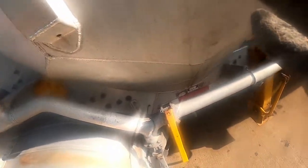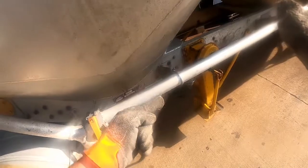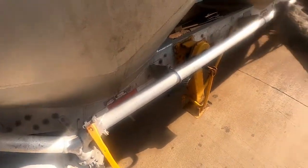When you close this, you're gonna spike your line pressure. So as soon as you close that, get over here, grab your valve, and just slam it open all the way. Then you're gonna watch your tank pressure gauge on the right. It's gonna drop. And then quickly you're just gonna close it, watch your gauge. When it gets up to just before 15, slam it open, slam it closed.